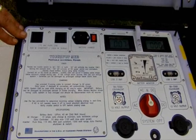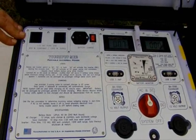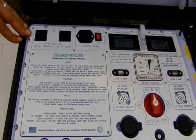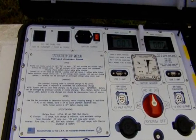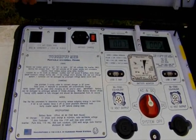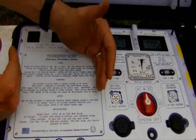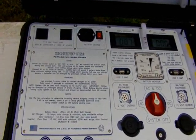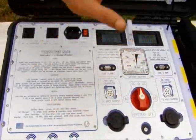The efficiency gain is also a factor. Depending on what you're doing — like running a small fridge or something that uses a compressor, or items with certain motor controllers — the pure sine inverter will actually use less power. When you're talking about portable batteries, that can be huge. So you've got your pure sine inverter, charging ports, air vents, and all the critical instructions are here on the panel. You've got the meters, switch, standard 12-volt sockets, and a circuit breaker as is standard with all of our gear.